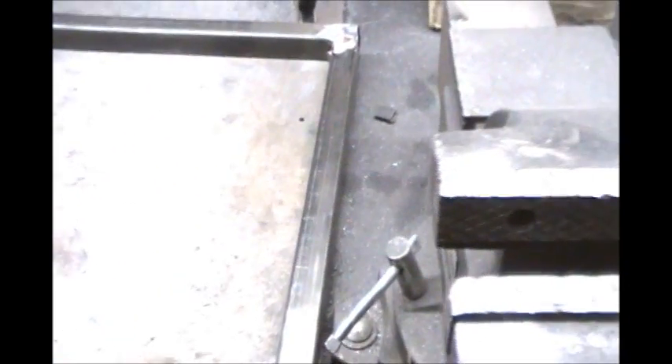First off, I built a base and welded it together — one inch square, 16 gauge tubing, and it's all welded. I believe it's two feet, and this distance here is, I believe, 16 inches. If it isn't, I will show what the correct measurements are right about here.